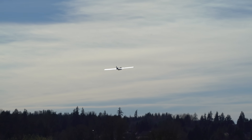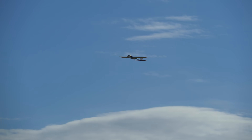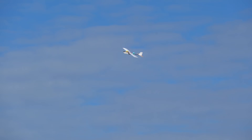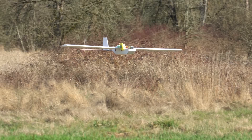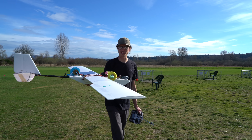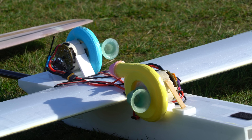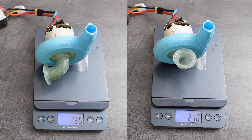As an armchair pilot it seems like it's about the same — it doesn't feel like it has any less power. It feels pretty much completely the same. I've heard so many people say EDFs get all their thrust and efficiency gains from the intake, but this might prove that statement wrong. This thing's still climbing on its own. Back-to-back thrust comparison showed zero difference — 260 grams of thrust at both angles. Pretty interesting.